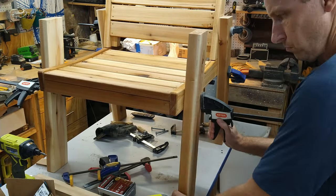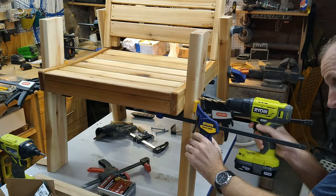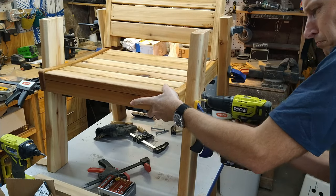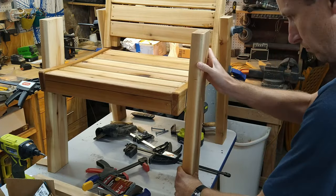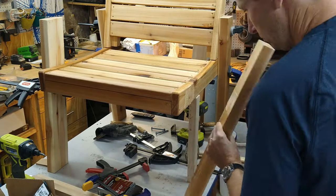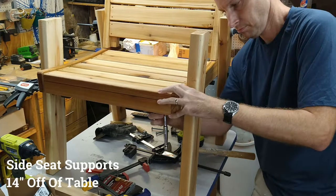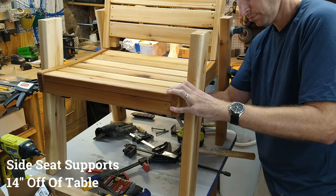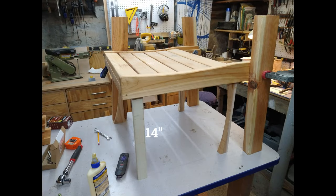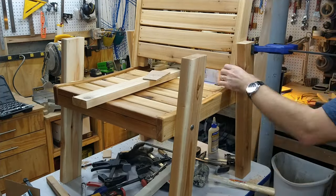My first prototype is a little different from the other four — it's about two inches shorter. Next step is to attach the legs, done with glue and stainless steel bolts, I think three eighths inch bolts. The general idea is to get the seat bottom lifted up by a riser about 14 inches off the table and drill a hole through and secure with the bolt. I do this on my assembly table so that it's perfectly flat and I can get the legs at exactly the right height and angle. On more chairs I went with multiple supports so I could get all four corners at 14 inches exactly right.